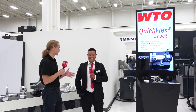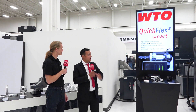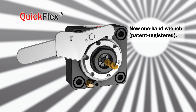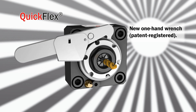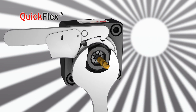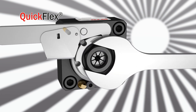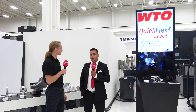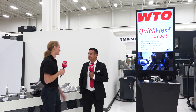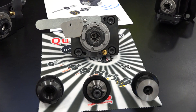So your skiving unit, that's on display here at DMG Mori. We have it on the NLX 2500 and we're going to be showcasing the tool holder throughout the week. With the technology cycle that DMG Mori offers, you can do OD splines and ID splines — helical gears, straight gears — basically on your turning center without having to change the process over to a different machine.